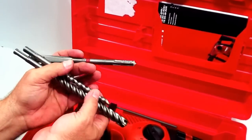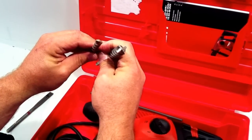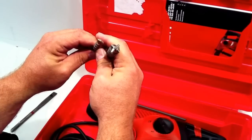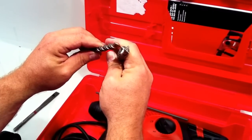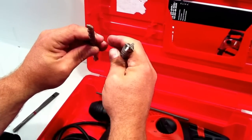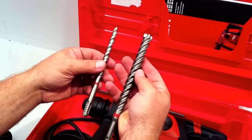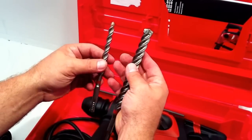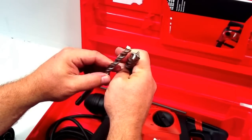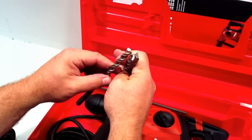An interesting modification Hilti has done on their standard bit is that instead of using one piece of carbide, they actually use four pieces of carbide on the tip. These bits last an absurdly long period of time and they also work faster. So when picking this drill, think about what kind of bit you want and how long you'll be using it. For a short simple job, use the standard bit. For a longer job where time and efficiency are important, buy a Hilti bit.